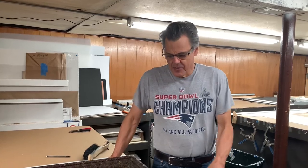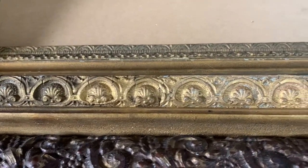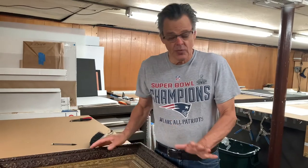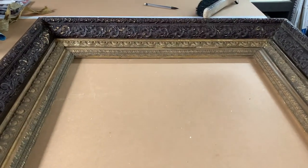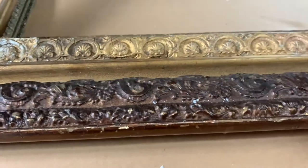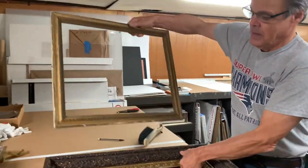Back with our frame restoration — don't freak out when you see the color, but this is where the replacement pieces from the mold have been put in. What's going to happen is I'm going to take the whole area and do it with this antique-colored gold Rub 'n Buff — you can see a little test area here. Once I get this all to the same color, I'll come back and antique it so it's not so bright. Now, the hard part on this frame is going to be this area right here. What we didn't talk about initially is that this is called a stacked frame — it's actually three frames put together — and this piece here comes out.